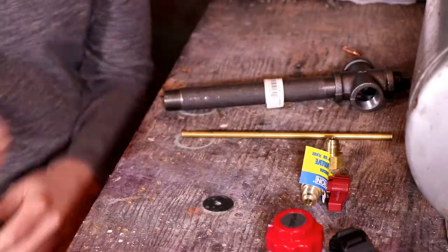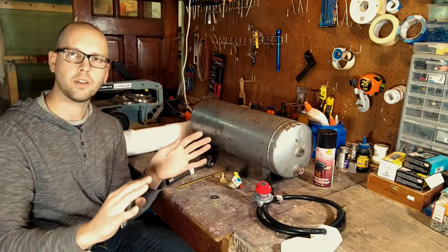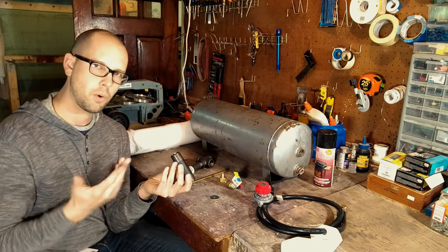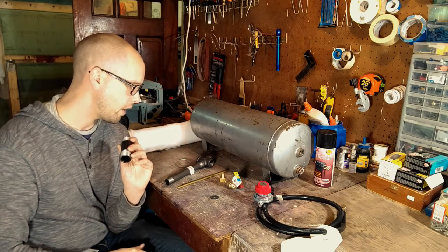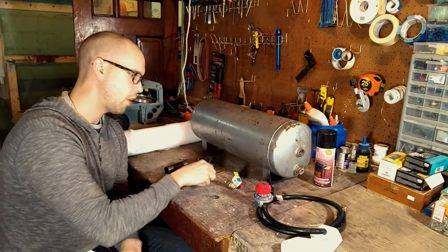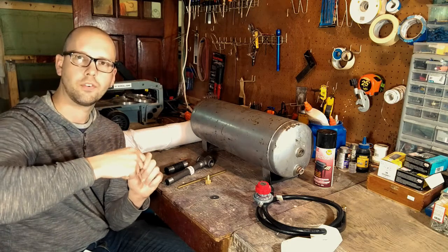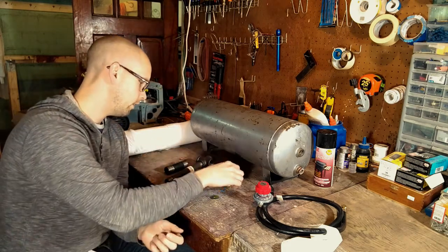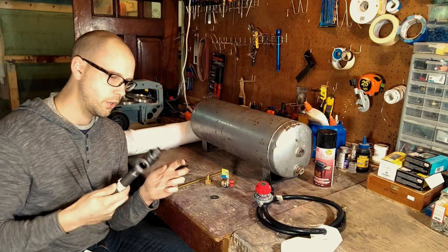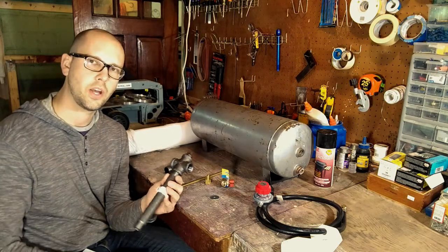On the end of this I have a larger piece of pipe that will act like a flare to allow the flame to expand as it goes into the forge. I might consider heating it up and flaring it out even more after I've had some time to tune this. It's also nice to have a shut-off valve so in case something starts to get out of control you have a quick shut-off. Keep anything brass or soldered a little bit far away from the end, because when you shut your forge off it could suck hot air out and melt those solder joints.